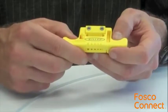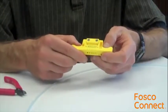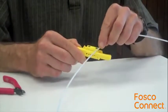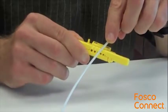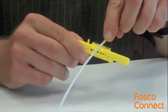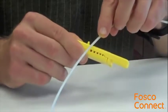Selecting the Correct Stripping Size: Be sure the tool is closed. With its intuitive design, the MSAT-5 invites the user to select the correct stripping channel by first using the sizing grooves located on the face or top of the tool. Starting with the smallest number 5 channel, locate the correct slot in which the tube is fully seated.